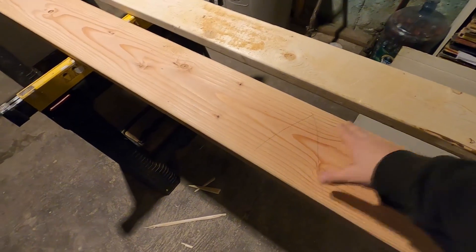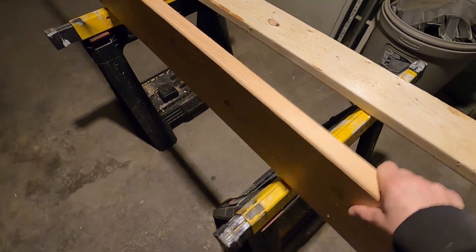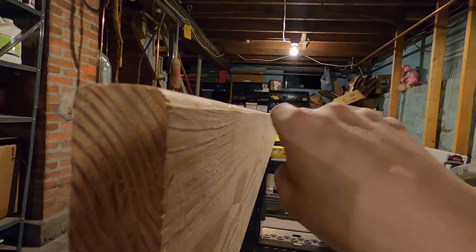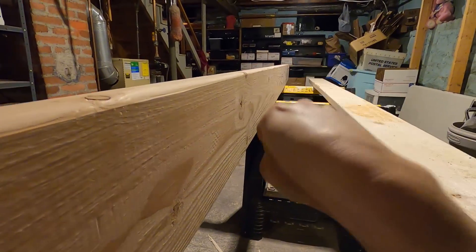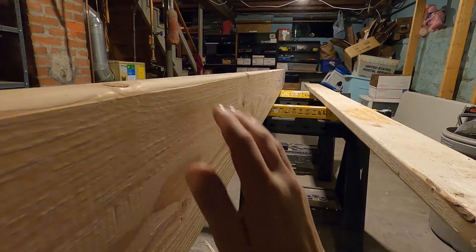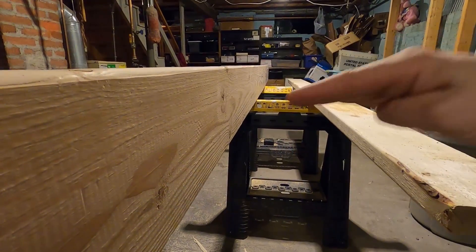So what you want to do once you find your crown on each of your boards — the best practice is, for instance with floor joists, you want the crown to go up this way. So now for your floor, this board is going up like this instead of having a dip in it going down. This is especially important in exterior decks, where if you had a dip in the middle, that's going to collect water. This way it won't collect water and it'll be more consistent throughout the entire deck. If you just put them whichever way, the deck is going to do something like this.